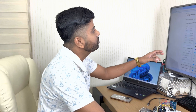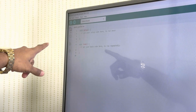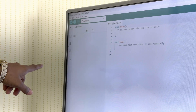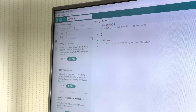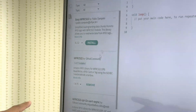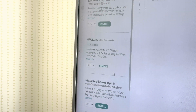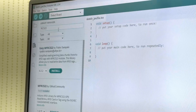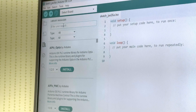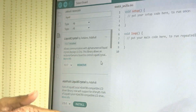The next question is about problems while connecting the RFID and LCD. For that, you need to go to Arduino IDE and download the libraries. To download the libraries, go to the library manager. If you want the library for RFID, you have to search for MFRC522 — you will find a lot of libraries. I have already downloaded this one, so you just install the library. Similarly for the LCD, you have to search for LiquidCrystal. I have already downloaded this one — download and install it.